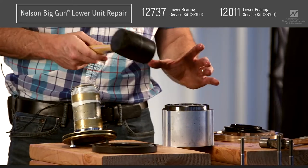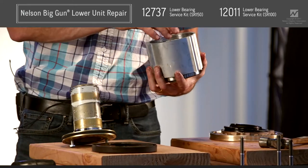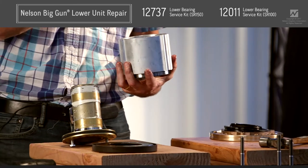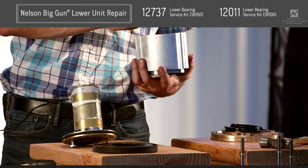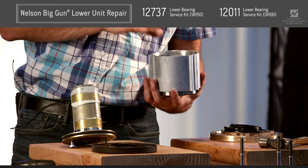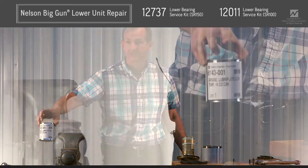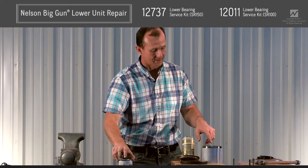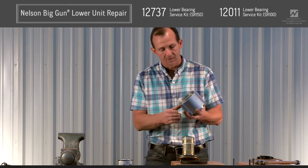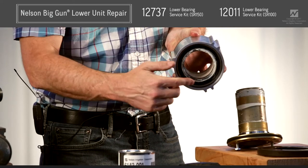After you've done the lower bearing, flip it over and tap the upper one out. Reverse that procedure to replace the bearings — just slide them in and tap them in. There's a slight interference fit of about half a thousandth to one thousandth, so it doesn't take a lot of force. Make sure they're parallel to the surface and tap them down until they hit a hard stop in the aluminum. After putting the new bearings back in, take this can of Lubriplate grease and put as much as you can into the cavity. Using a tongue depressor is the best way — spoon it in and push it up into each individual bearing.